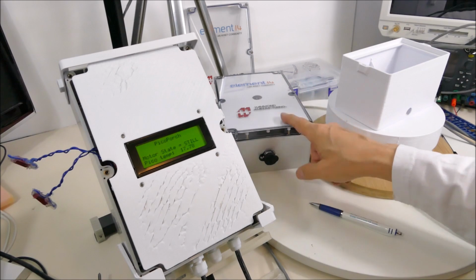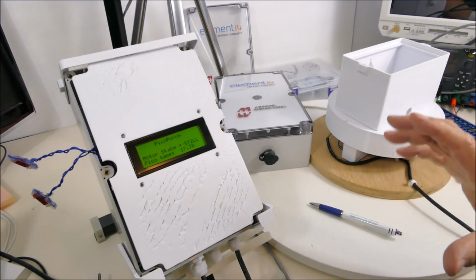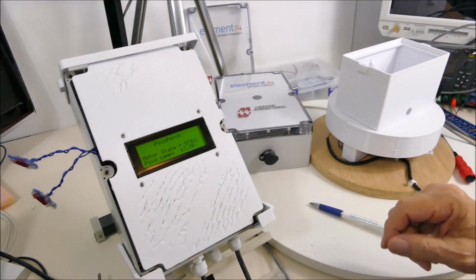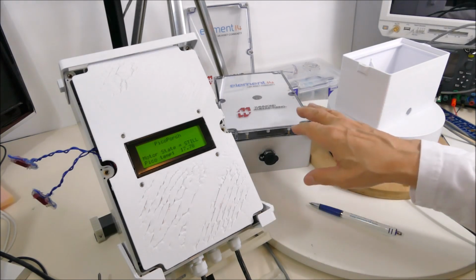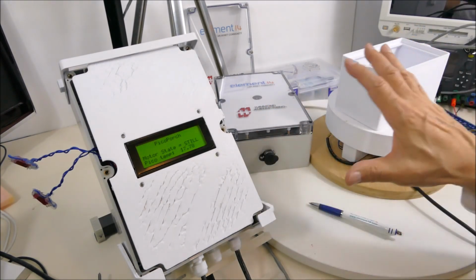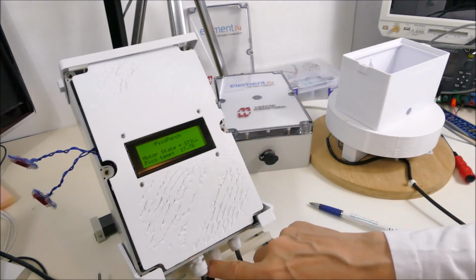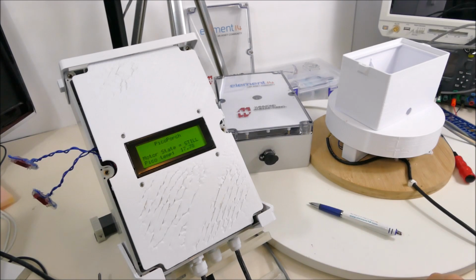And the fourth camera is this Pi Camera Module 3, which is the autofocus camera. So now I've got 4 cameras and they're all running. 3 of them are running MotionEye OS and this one will be running a separate streaming program. But they're all basically serving video from an IP address. So the rotating system is working and the waterproof boxes are all wired up except for these 2 cables, but all the infrastructure is there to wire them up, and then we take it outside and give it a shot.